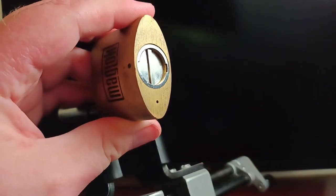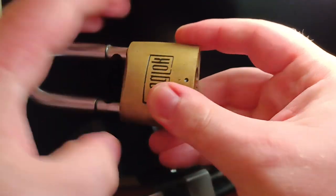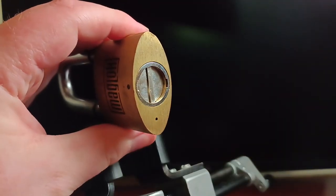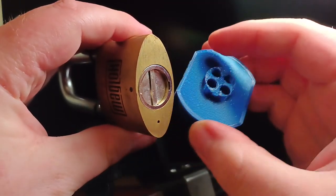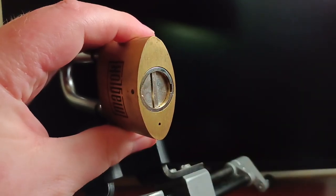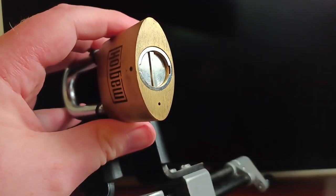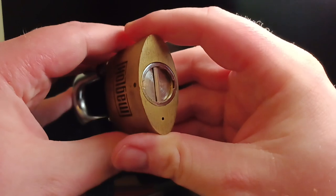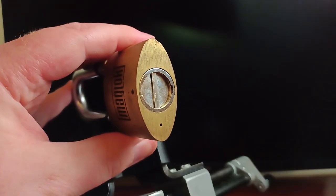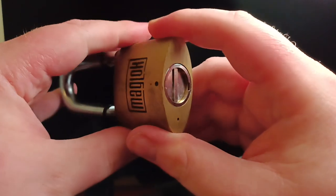And credit to Ark on YouTube, who has the only other video I've seen of this, for that idea. And there's this, which is based also on the thing he made. A couple of differences though, and the reason why I'm claiming this as a first is because, by his own admission, he didn't get any feedback from the lock, and he basically had to exhaustively try all combinations. I was able to get pretty decent feedback from this lock.